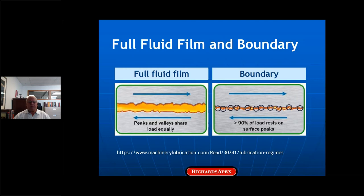The contact conditions translate into lubrication regimes. There are three or four that people talk about, ranging from full film to boundary. In full film, viscosity of the oil and the sliding speed drive the formation of a hydrodynamic wedge of lubricant that completely separates the surfaces. Remember that viscosity increases almost a hundred times under the pressure in the die due to the pressure-viscosity relationship — at very high pressure, lubricant films act almost glass-like. In boundary conditions, the asperities carry more than 90% of the load, and the resulting friction is about ten times greater than in full film.